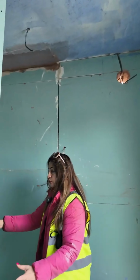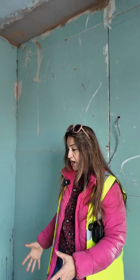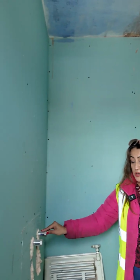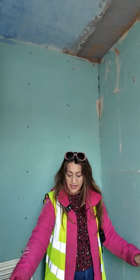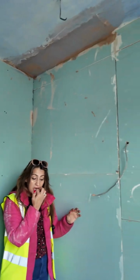Here you can see the bathrooms. Another quick tip that Ben gave me, which I would like to tell you as well, is always have the wash basin right next to the shower, because obviously this only comes out at about 500 millimeters, maximum 600. And here are the mixer taps for the showers. The showers are actually good sizes, about 1 meter by 800. So slightly unusual sizes, so it was slightly difficult to source them, but Ben's done the job. He's managed to get them all done, ready for delivery today.